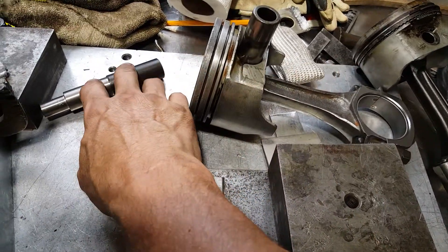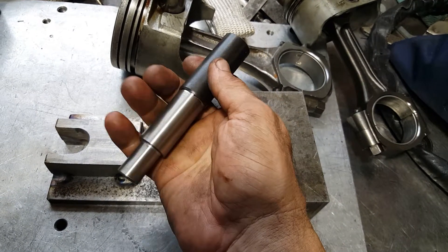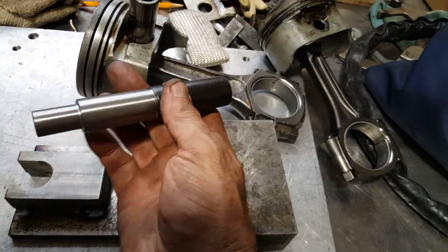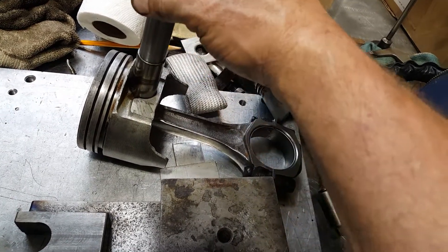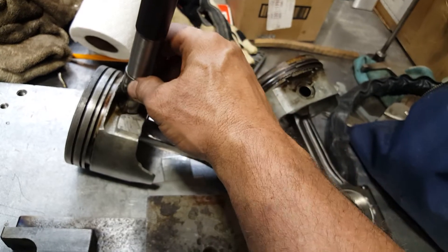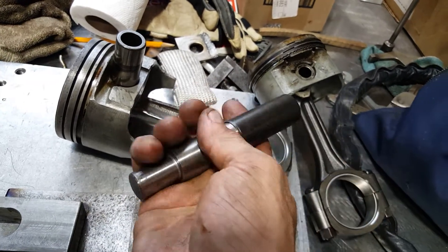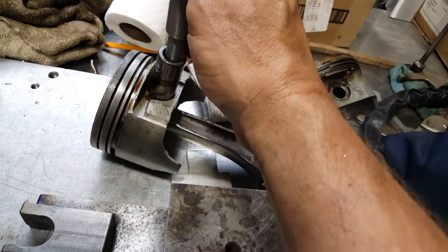I also machined a mandrel — I think this is an old one-inch bolt, probably about 15 inches long, so I can cut another piece off and make one for a small block Chevy. This fits in here like so, and it locates everything. It's not really tight but it works — it won't fit a small block Chevy so I'll have to machine another one. Didn't take long, 15 to 20 minutes maybe. Works great, no problems — set it all up and press away.